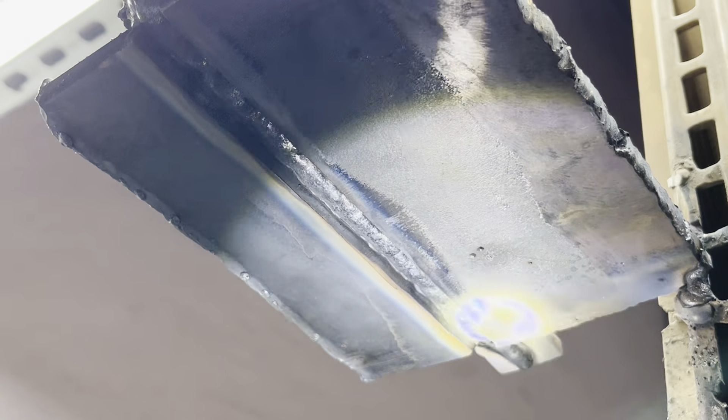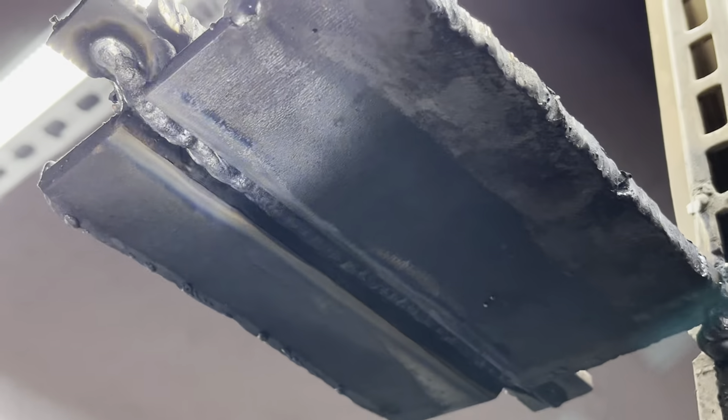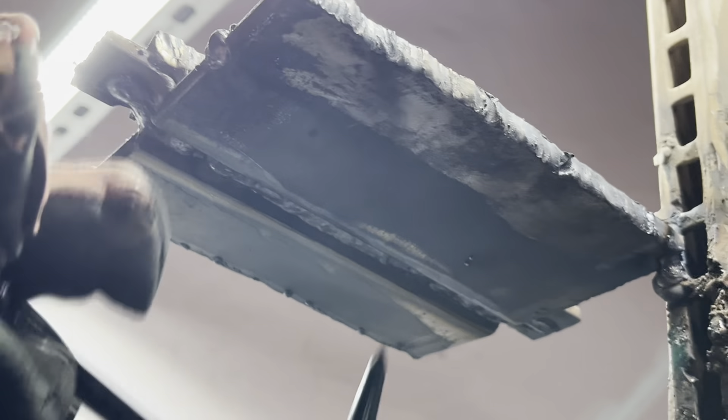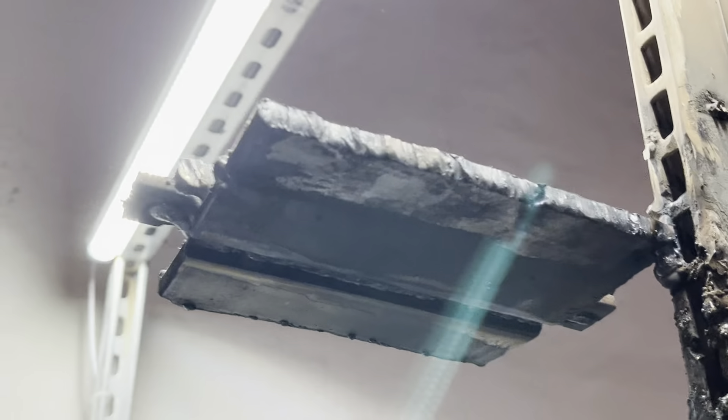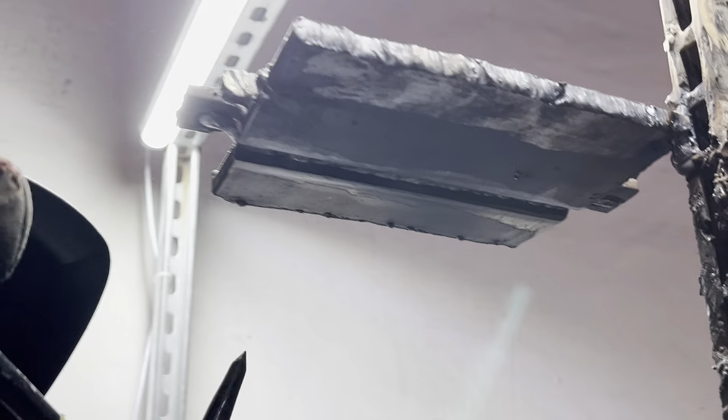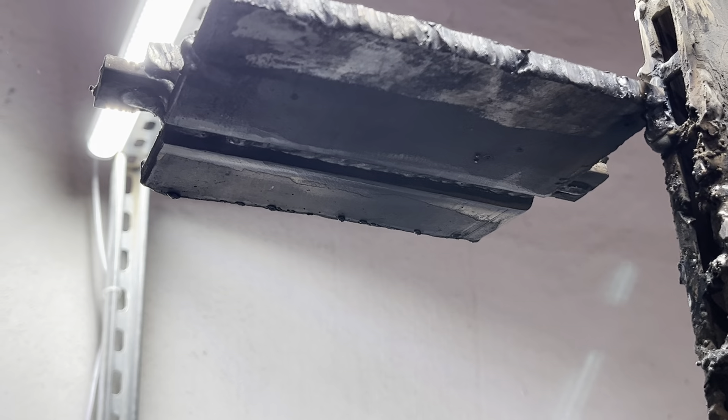The root laid in pretty good. I'm going to clean it up so you can see it. Normally with the flux core, you can run pretty quick and the slag will fall off pretty good as long as you don't hesitate — if you don't go real fast and you take your time, it should go pretty smooth. I'm not even going to use any power tools; I'm just going to use the wire brush and the chipper hammer, because if you run it right you won't have any issues. Now I'm about to weave and do my hot pass.